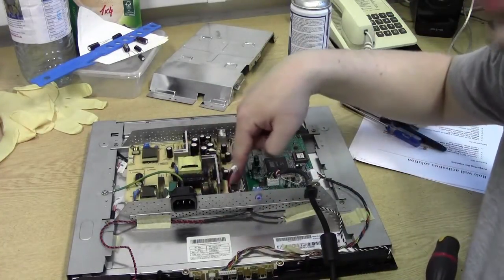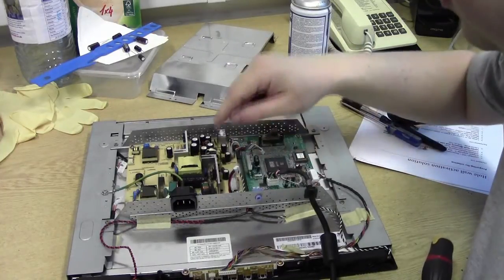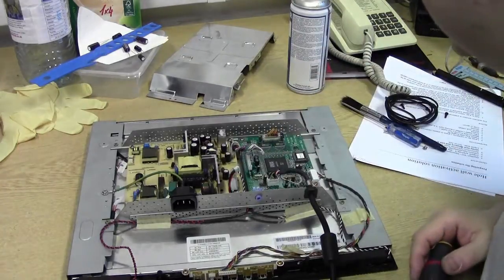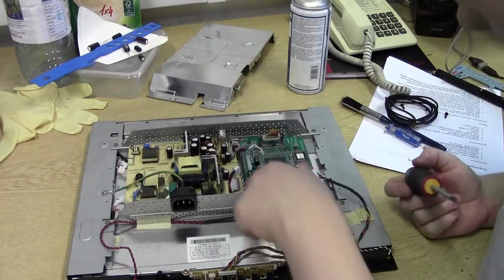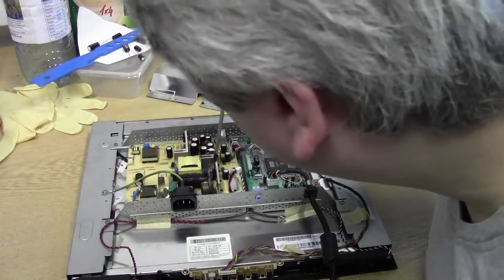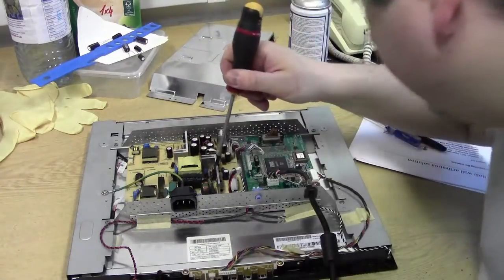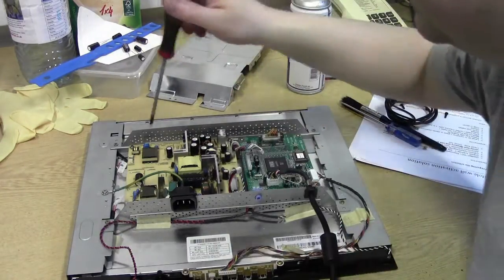Goes off down to our power supply board, and I've actually mounted an audio amplifier onto the power board itself rather than on the main processing board. Why? I don't know. And then it's fed off to left and right with a coupling cap. Probably over here, that might actually be the supply, or it might be the supply from around, who knows. Can't tell from this side.